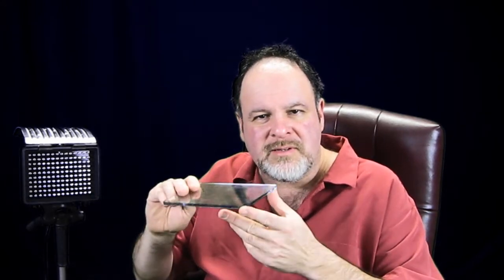is because they have a very thick, like a 1/4 inch pane of glass on there. And the only reason I can think they're using this is because this is what's typically used for quartz lamps, which generate a lot of heat. So this is really not necessary, and in fact this blocks some of the infrared light that comes out of the LEDs actually. So I removed this. That's the first thing I did.